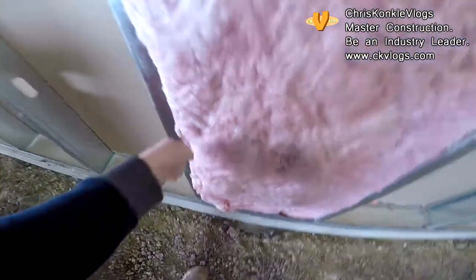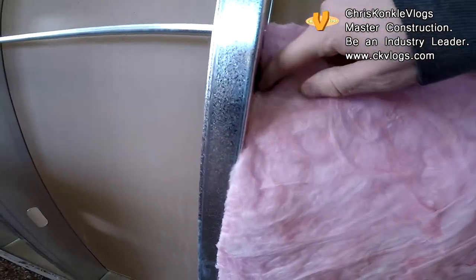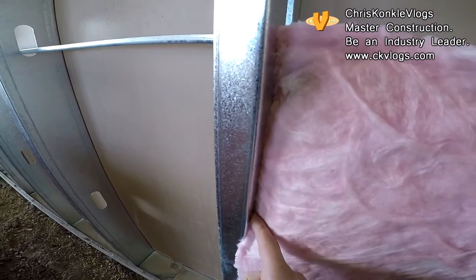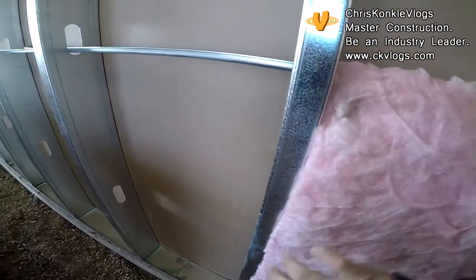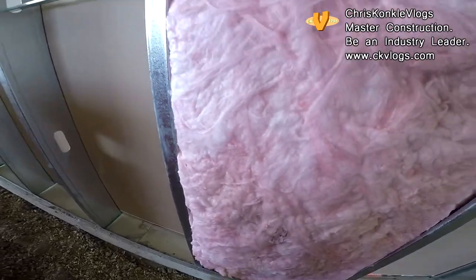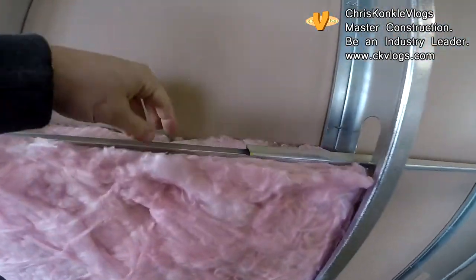When you're insulating, if the insulation is inside of the stud, that's a cold space where moisture can gather — it'll be a cold spot, a freezing spot. You want to make sure it's just outside of the stud with your lap in there. It goes into the bottom track and just fluffs over here.